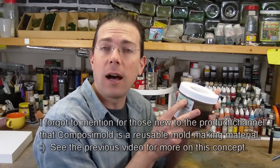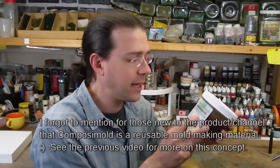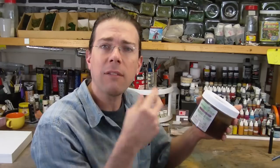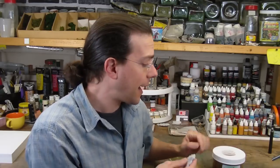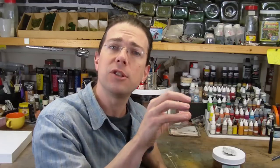Actually, I commented on one of their videos first, and then they found my video. And we had a little bit of an exchange through YouTube comments about tips and ideas. Then I asked them if it would be helpful if they could put up a video on how they control bubbles in the pour. Because that was the main problem, if you didn't see the previous video: bubbles attach to the master so that when you demold it, you have an irregular surface that you can't really cast into very well.